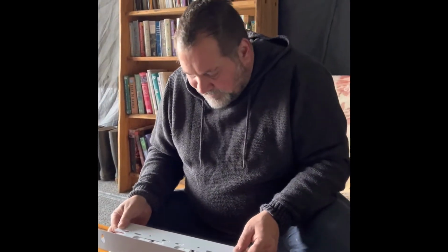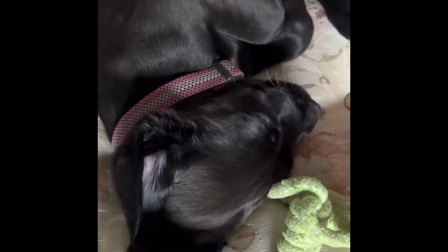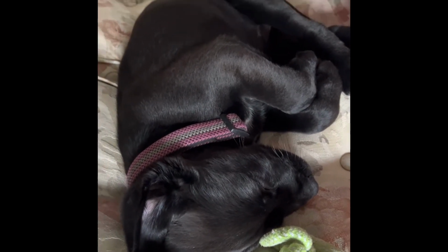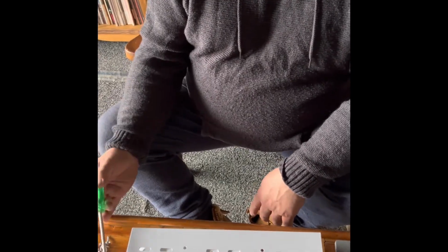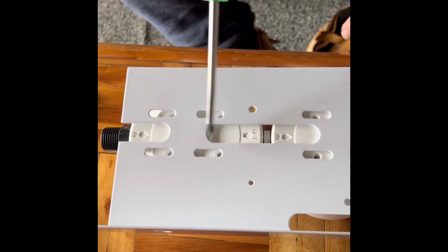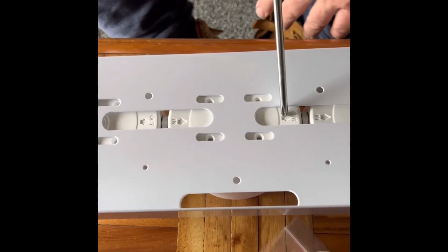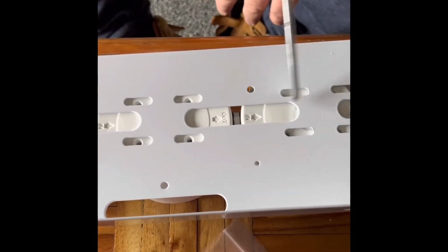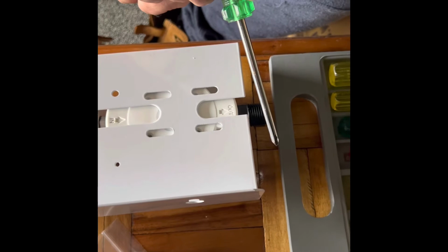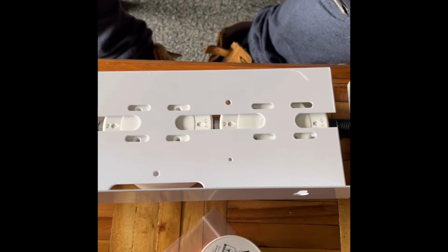So now we sit our bracket on, and we line our bracket up. So as you can see, the water tank will be here. It will pump into this one. So water in, water out of that filter, which is the polyspun filter. Water in to the carbon filter, water out of the carbon filter, water into the ceramic filter, water out of the ceramic filter, water into our shed, and then into the UV filter, and that will give us drinkable water.